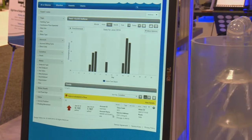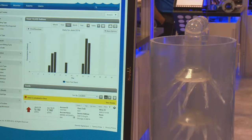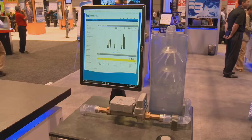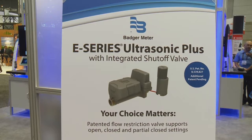The E-Series Meter is different from other meters with valves available today. First, it has a patented flow restriction technology — specifically, the valve can be put into a fully open, closed, or partially closed position. This allows the utility to close the valve partially to modify a customer's behavior without fully shutting off service.